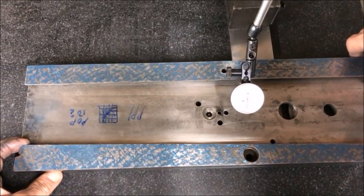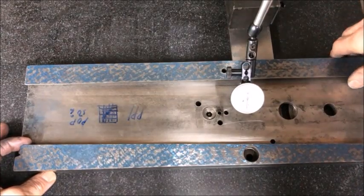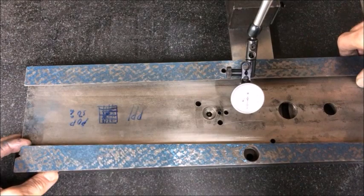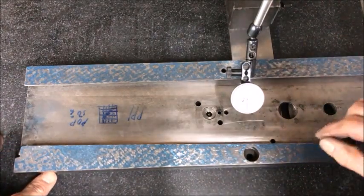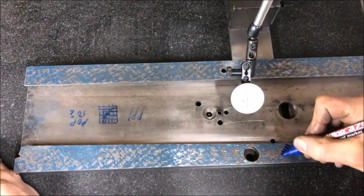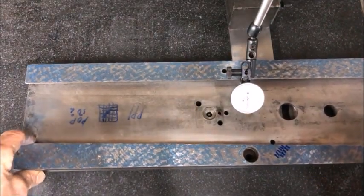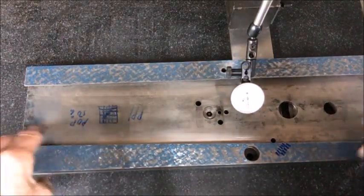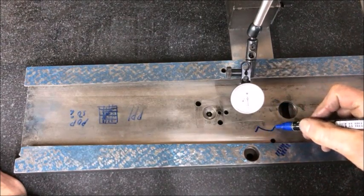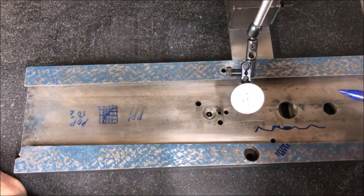One of the things to emphasize is the depth of cut, which is important because it really defines the longevity of your work — how long the machine can last. The more points with sufficient depth of cut, the better. Each cut will be defined as individual marks on individual rows — that's one of the key things. The high points then decide where you scrape, so you have oil pockets of sufficient depth — say five thousandths to one hundredth of a millimeter — with a pattern where you have oil pockets in the valleys and support points on top.